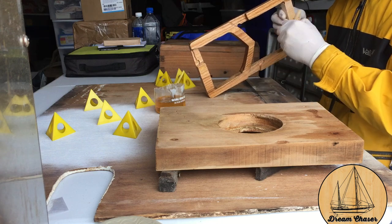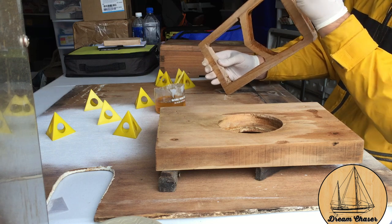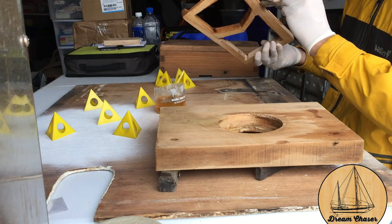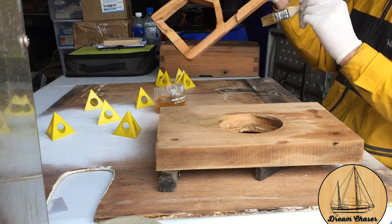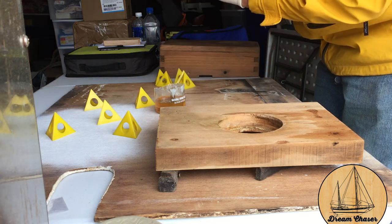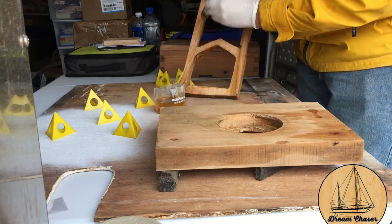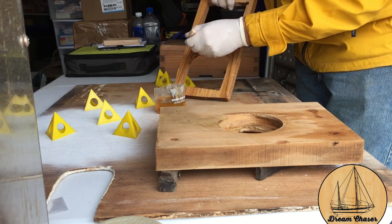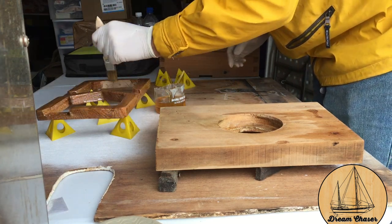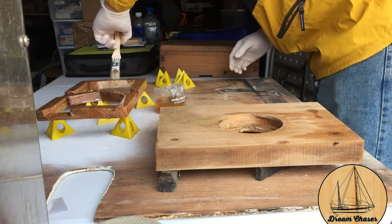This is the outside edge I was saying I don't want to build up too thick because it's going to make the joint between the Dorado box and this base even tighter. I'll put a coat on and come back with sandpaper when it's dry to get it nice and smooth. I didn't make this out of teak — this is red oak. I figured it's a good hardwood, it's fairly inexpensive, and covered in epoxy resin it will be more than strong enough for its duty. You won't see it, so the boat will still have the aesthetic look of the teak where everything's exposed.